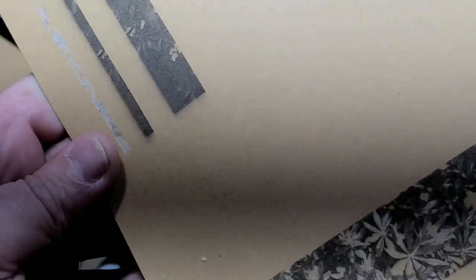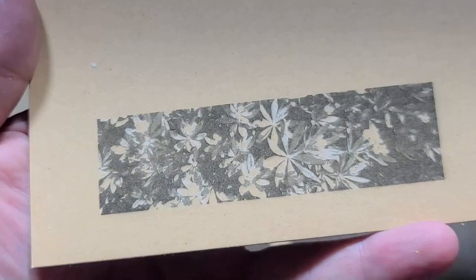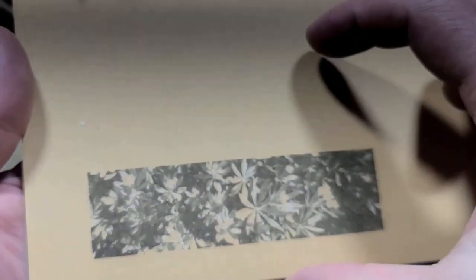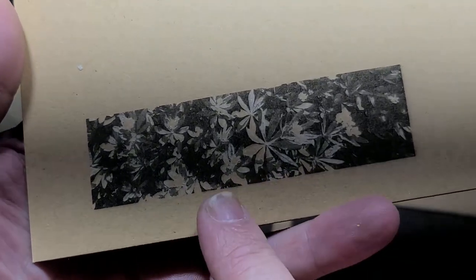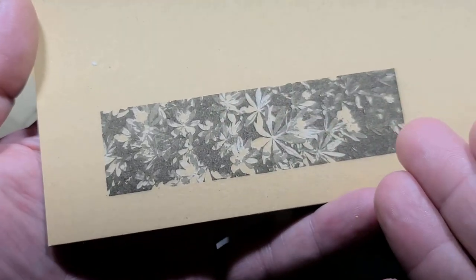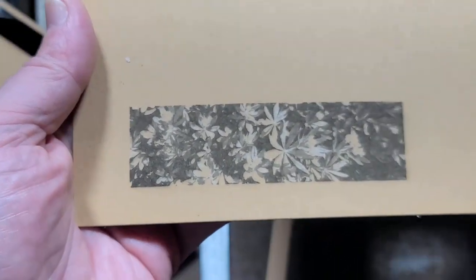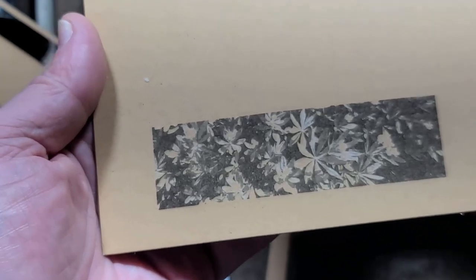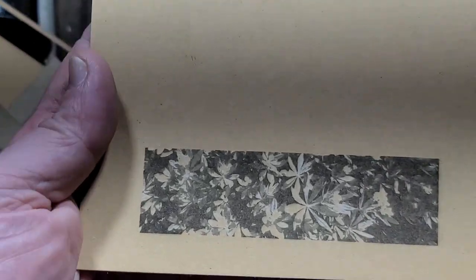Other things I wanted to point out is you can certainly import images. Let me zoom out a little bit. This was an attempt at doing an image, and it was going to take more than an hour just to print a small image. But with the variable output, you actually can get a tolerable grayscale for doing embossing work. And I had this resolution set to 10 lines a millimeter, so it was really high resolution. The program put out over 500,000 lines of code to produce this image. If I had let the whole thing print, it was just taking too long.